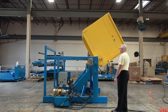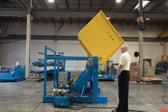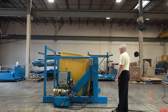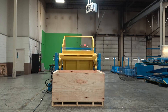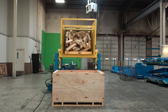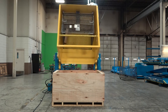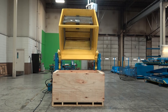You may note the shaking feature is at the 90-degree reversing position. The programmer may select these positions based on experience with common loads; the factory sets the shake position at 90 degrees unless otherwise specified by the customer. This unit was tested through more than 1 million cycles. In this video, we are dumping square-cut pieces of 4x4 lumber cut to various lengths and held in a wire mesh basket that can capture the corners of the lumber — a difficult dumping challenge that demonstrates the advantage of the load shuffling feature. The shuffle feature can be user-programmed at whatever angle and speed the user prefers, based on their experience with their exact loads.